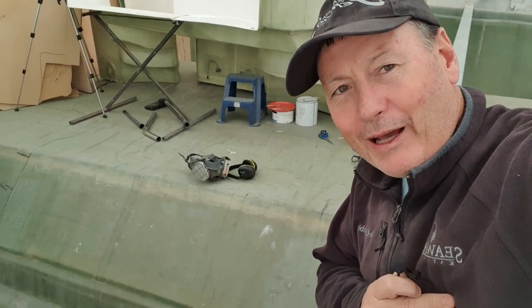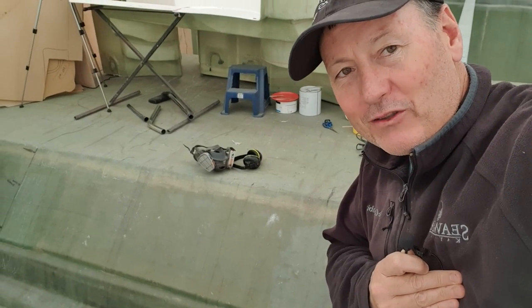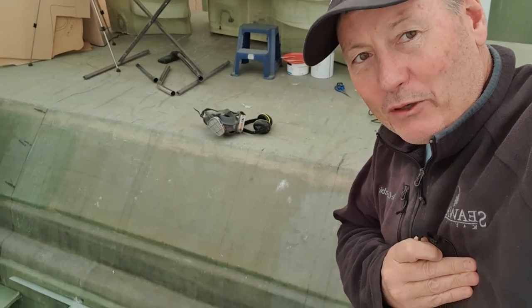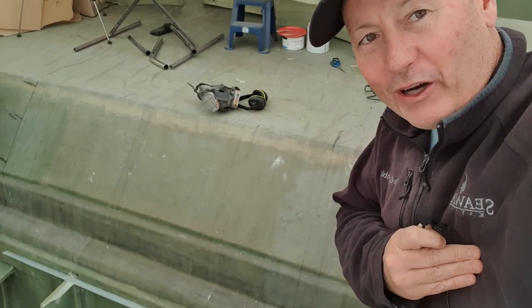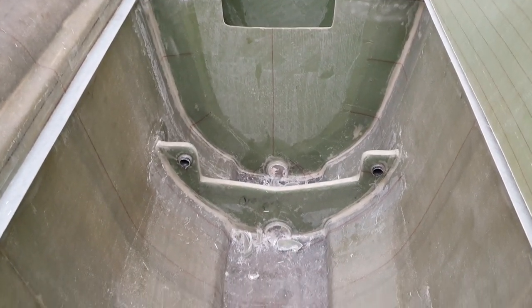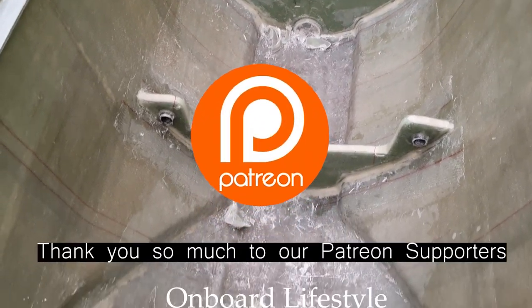Now, those new blades are actually designed for cutting fiberglass. The great thing about these oscillating tools is there's not a lot of dust, so you don't have to worry about airborne dust. It pretty much falls straight to the ground because it's not flying everywhere. So what I've got to do now is just give it all a light sand and ultimately tidy up any little rough edges, and pretty much that's ready for flow coating.